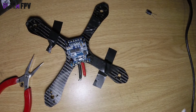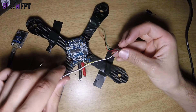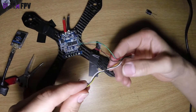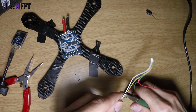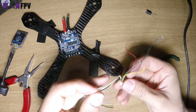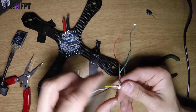This VTX has an all-in-one power cable that connects to the VTX and directly to your HS1177 camera. I'm going to cut this off to connect the camera side to the necessary video camera point on the PDB, and connect the VTX half to the VTX solder point. It's good to remember that the power output to the camera from the VTX won't be necessary any longer because we're getting power to the camera from the PDB, so I can remove those two cables.